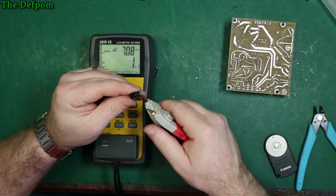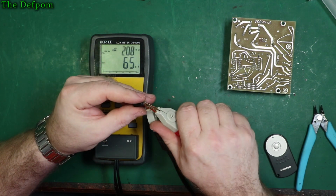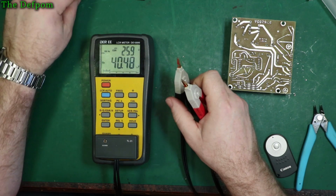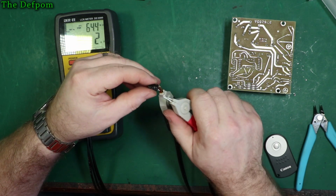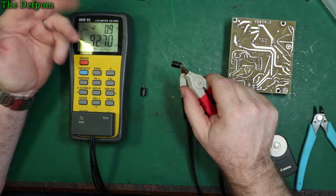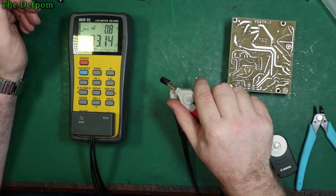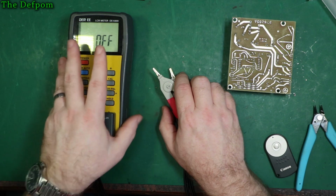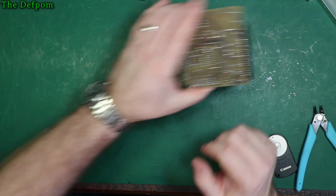This is a 100 microfarad, 16 volt. You've got 3 of these. 90 microfarad, 91, slightly low, 1 ohm. Yeah, that's alright. .2, 1 ohm pretty much, 0.9, it's okay. 93, 1 ohm, so it looks like the power supply caps were at least looking alright. So any issues I saw initially were probably from those other boards.